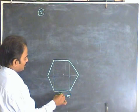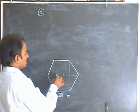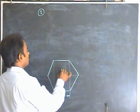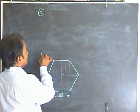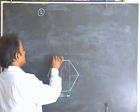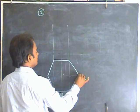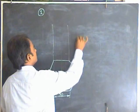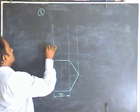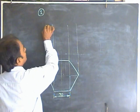It is a simple position. The base is on the ground, on HP. So we start the top view first. Now let us go for the front view. We introduce the XY line. We project these edges. We take a height of 80mm and finish this rectangle.